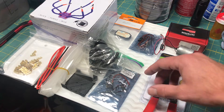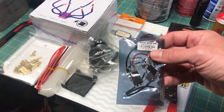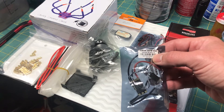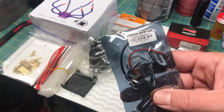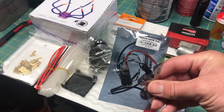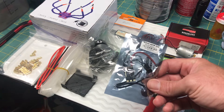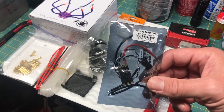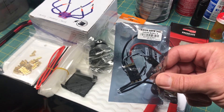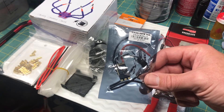I got a 30 amp, 2 to 4S LiPo BL Heli S ESC — it's really no bigger than my thumb, so I was thinking it could fit really well in these small crawlers. There are also BL Heli 32 ones with a 32-bit processor, which have more options when you program them, like slow startup and that kind of stuff.